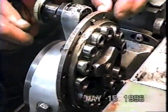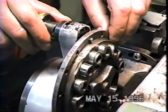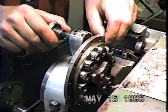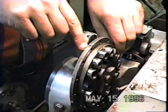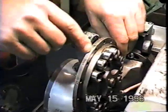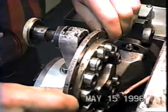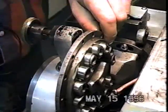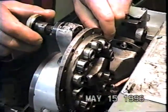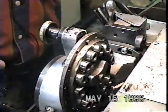The next device is the bushing plate and bushing plate holder. All we need to do to release the bushing plate is to pull it back and turn it to the right. On the rim of the device is stamped the drill size numbers — for instance, a half an inch, 3/64, and all the way through the range of the drills on the device. Right now we're doing 17/32nds. So I bring 17/32nds to the top, the bushing is at the bottom, turn my device back, and just work it in, and you can see the pin come back into the hole.